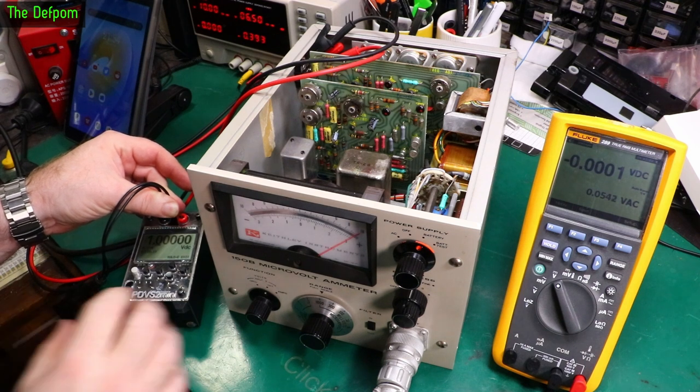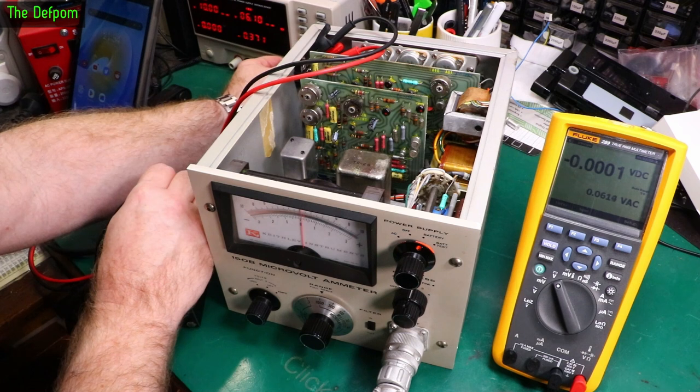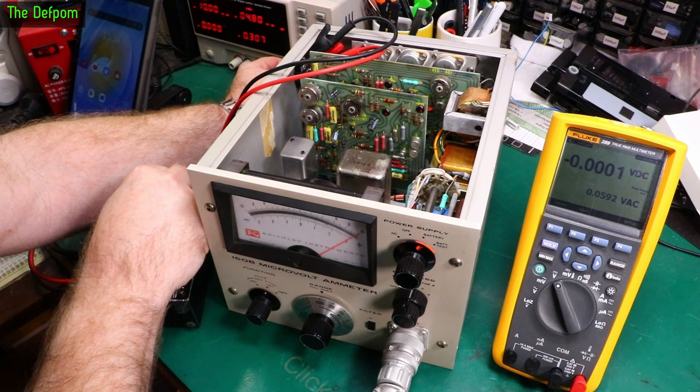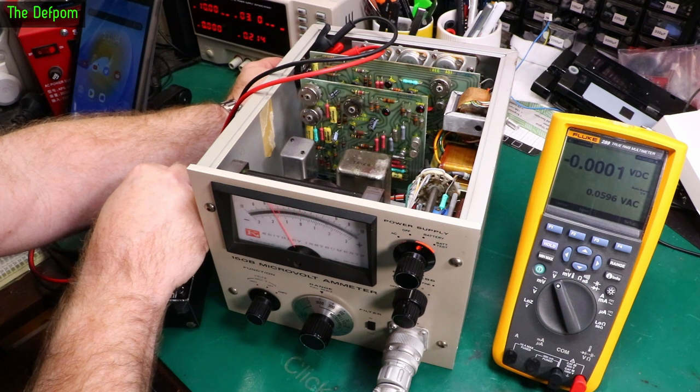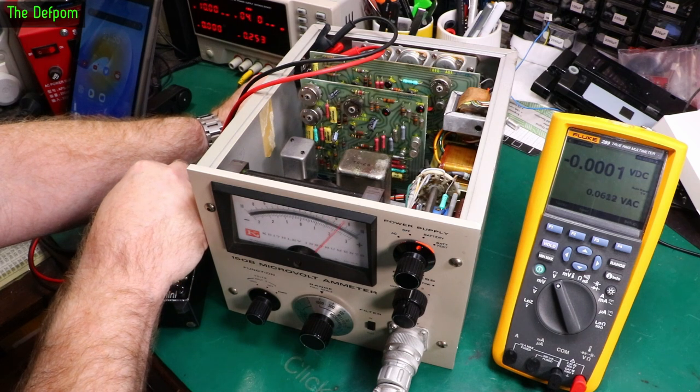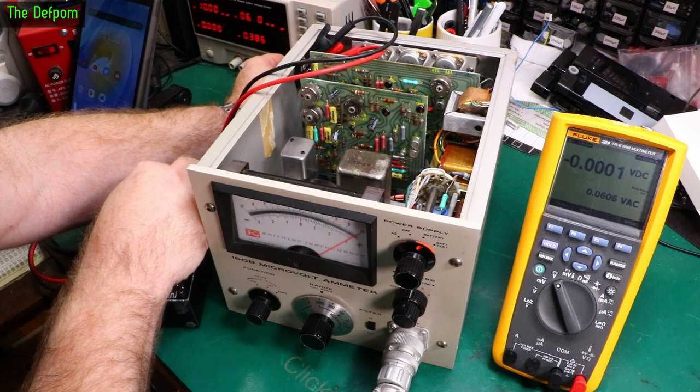Shall we see what voltage it will drop down to before it decides to not behave properly? So 6 volts. Trying to hold these terminals on. The chopper's changing. You can hear the chopper changing. That's 5 volts. Four volts. Yes, killed it there. Bring it back up again. So it looks like you could say probably safe margins, 4 volts. Absolute minimum. Maybe, if I get good connection again. But it sounds happier above 6. The chopper frequency doesn't change between 6 and 7.